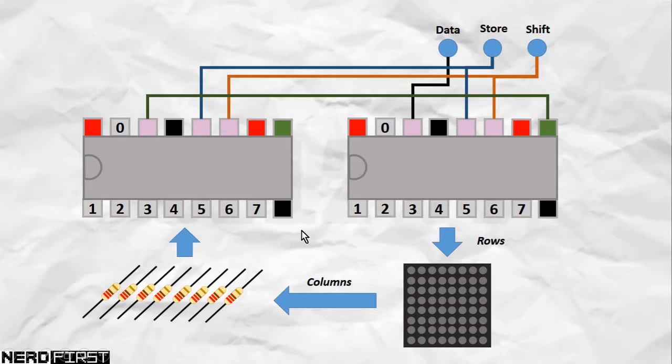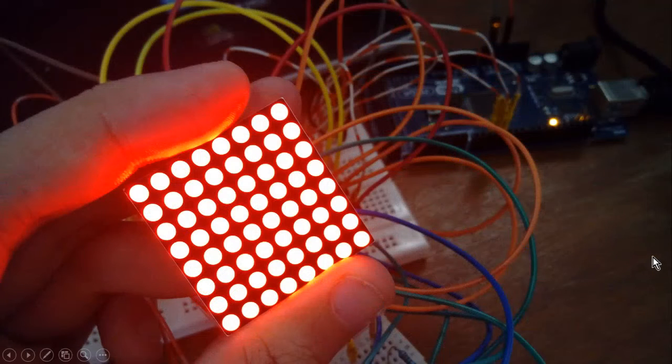If you do not see any LEDs switched on, or if you have any rows or columns missing, that means you've probably connected something incorrectly. At this point there probably isn't anywhere for your code to go wrong, so check your physical connections. If you have everything switched on, you're good to go. So let's draw our usual little smiley face. What I have here is an array containing the actual information to display, represented as numbers.